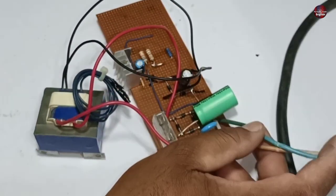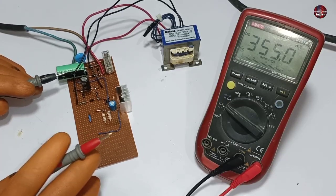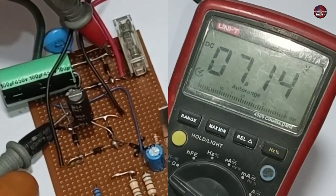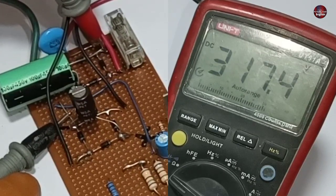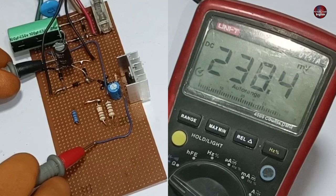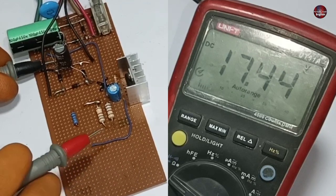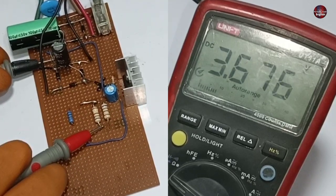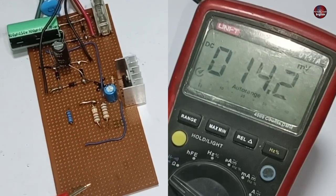Now this circuit is ready to be tested. As you can see, I have passed electricity to the circuit. Now I will check the voltages of this circuit. We need 320 volts, which we will get at the capacitor, by placing one probe at the ground and the other at the DC output point. Here the voltages are 317 volts — what we needed. Next, we need 15 volts. Place the positive probe at the jumper wire and the negative on the ground. The voltages are 17.46 volts, which is a bit higher, but as they are regulated voltages from the regulator, we can trust them. Next, we need 2 to 7 volts. I have placed the positive probe at the resistor point and the negative on the ground. We are getting 8.7 volts, which is still fine.